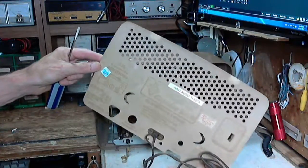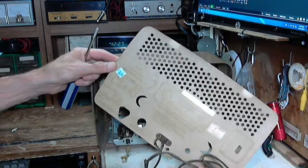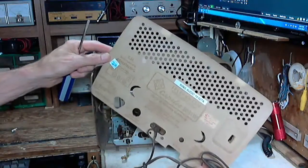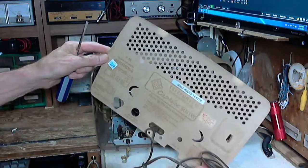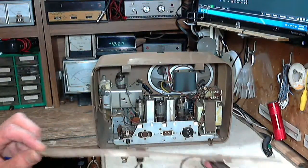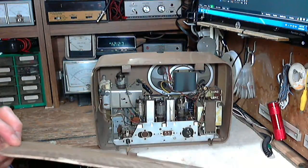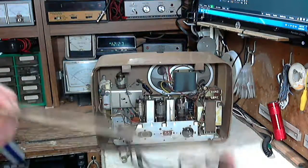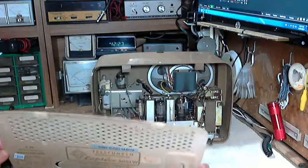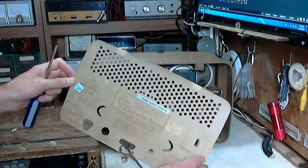Let's see what we can pick up on this. Telefunken Caprice 5051. I think I did a 5353 just a short while ago. FM system, licensed by Armstrong — isn't that interesting? Some antenna connections, power rating, dial lamps. It's got some fuse information. This guy only consumes about 35 watts when it's operating — not very much. People think a tube radio eats up power left and right, but actually the opposite can be true. Because the set runs on high voltage, there can be very low dissipation inside the radio, whereas a transistor radio runs on current, and current involves a little bit of watt loss.